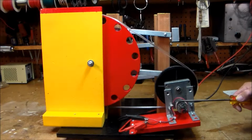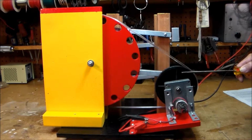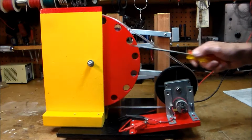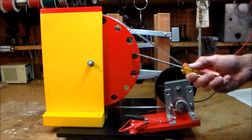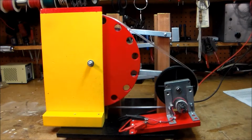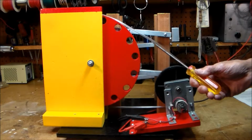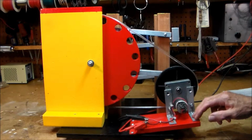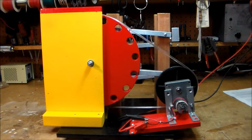And here you see the drive mechanism. First, I have a 24 volt DC motor, which is hooked into a gear reduction box, which turns my first pulley. My first pulley operates my marble raising wheel, which is 11.5 inches in diameter and has 16 holes for the marble. My pulley drive belt, of course, is made out of aquarium air hose line. The motor is mounted to a hinged board, which is spring-loaded, and this maintains proper tension on my drive belt, and the whole thing works beautifully.